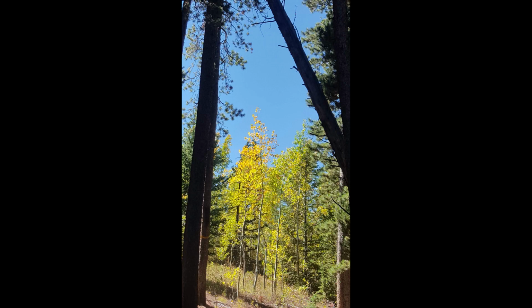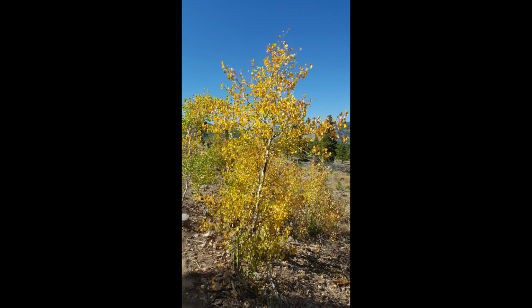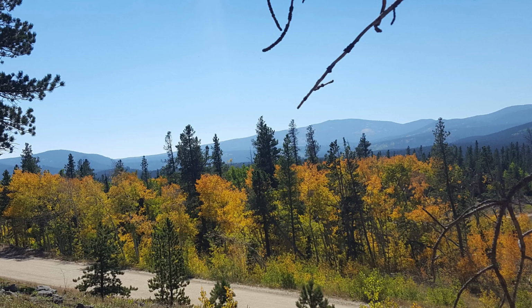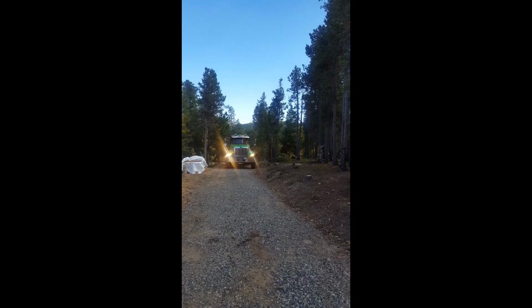It's now August 18th and we're seeing the leaves start to change a little bit earlier this year. So I called up the boom truck and got them on schedule to come out and put in the back two ridge beams. There had to be a notch in the back wall and a notch in the character post, but they have to be an inch different. Because the log wall will shrink and the character post won't, this has to be 1 inch higher on the log wall.